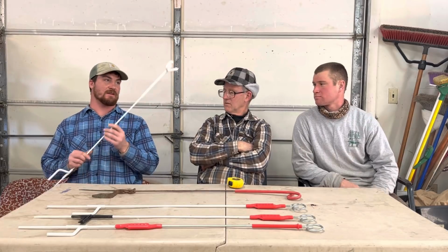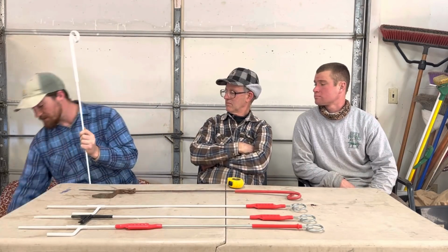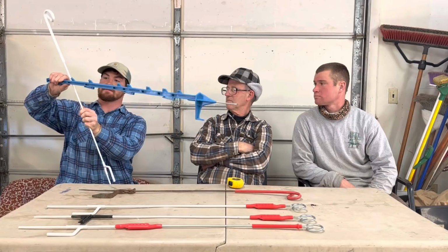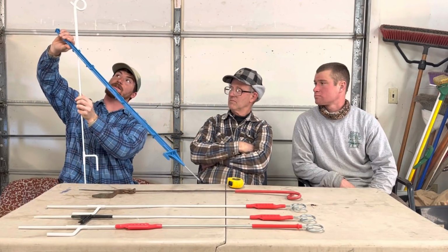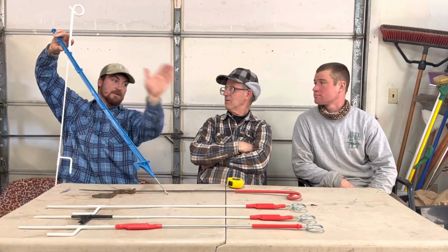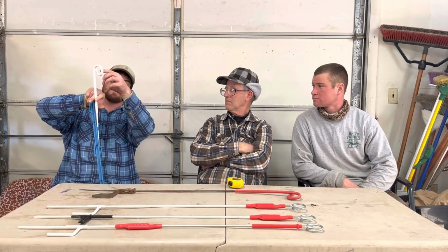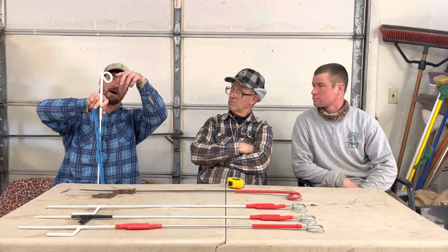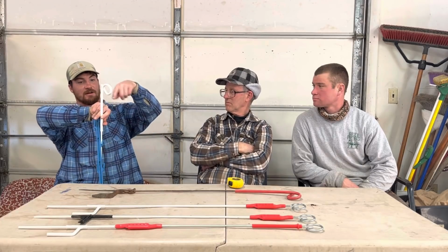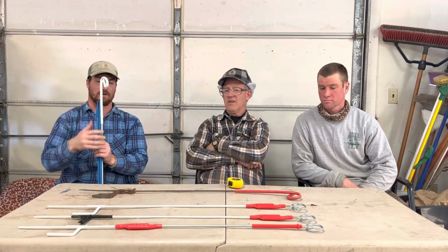And so we can stick this in the ground. So you just step it in with this, and then we'll brace it actually with one of these posts. So we'll brace it on the ground like that. We'll stick that in the ground, and then we'll either tie a wire here and start our fence, going wherever we're going, or we'll take a reel and we'll have another actual hot poly braid coming through this, and then we'll wrap the reel around here. And then you hook it on this. Yep. And then you've got a hot fence where you didn't have one.